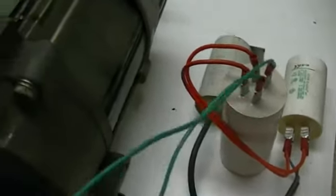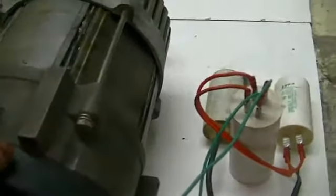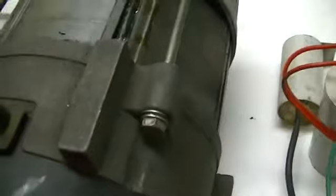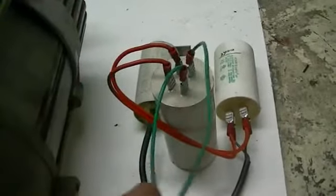We're going to switch the camera and have a look at the part of the generator that was totally forgotten about — which is the exciter circuit, or the tank circuit, within the generator. It's just a set of coils. We have our main set of coils for the 240-volt output, and we have a small set of windings for our exciter circuit. The exciter circuit is fired up by a couple of small magnets on the rotor. Those magnets fire up the exciter circuit, which makes sure there's a decent magnetic field to fire up our main output. Now we're going to have a look at what's actually happening inside this exciter circuit and then hook our reactive circuit up to it — something that hasn't been done before.